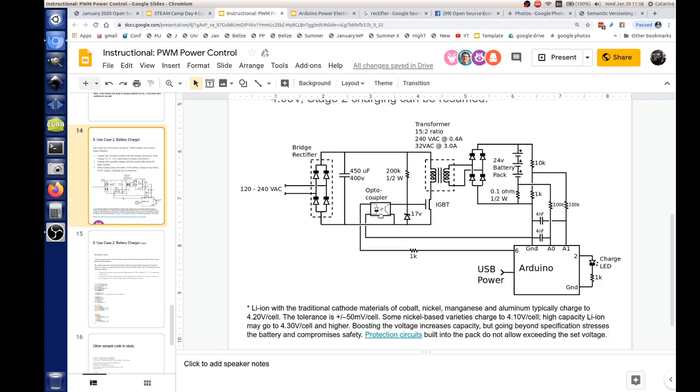I got these little capacitors there? Yeah, 4 nanofarads. I ran through some calculator to figure that out. I'm hoping that's the right value. But what's it for? We have two 4-nanofarad capacitors going to the A0 and the A1 input. What those do is smooth out the signal going into those inputs, because normally a chopped square wave, or PWM pulses, is coming into it. Going across here, it'll show those big square waves.